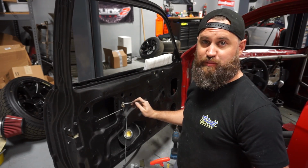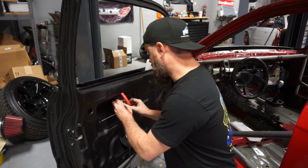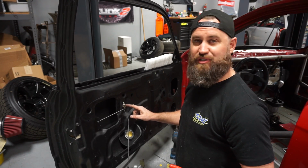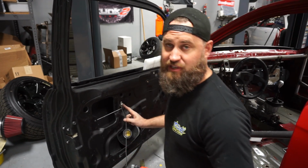And that's what I had to do for this piece here, because this is a pivot, and the square mount on the back of it is actually part of the plastic pivot mount, so we need to retain that. So Sabon had already created a square hole here. It was just a little too small, so I used a flat file, opened it up, and made it work, and now that's going to be usable.